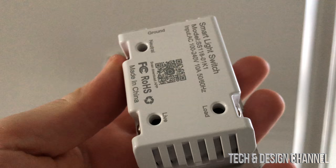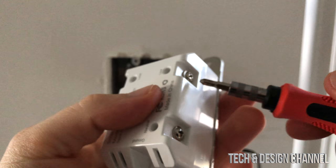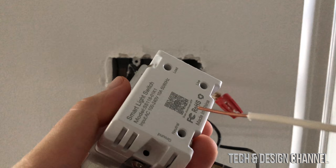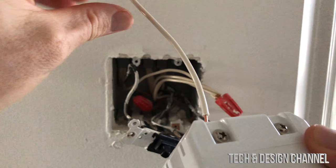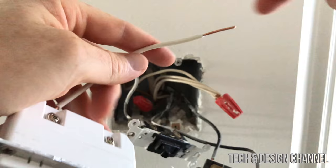As we work on that, we have to get the switch ready. With a screwdriver, unscrew the terminals a little bit — make sure they're nice and loose all the way around. Looking at the diagram: neutral, which is the white wire, goes right in here. Once it's in, tighten it up so it stays and won't come out. Then we just have to connect it up — we're doing this one by one, this switch first, then the other one.